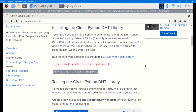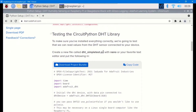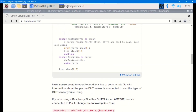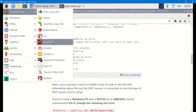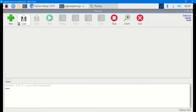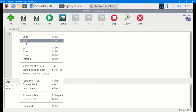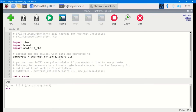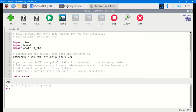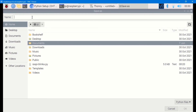To test, copy the sample code and open the Python IDE (Thonny) on your Raspberry Pi and paste it in. We need to make a couple of changes: change the sensor type from DHT22 to DHT11, and change the pin from D18 to D4. You can leave everything else as default. Save the file as 'dhtsimpletest.py' and run it by clicking Run.